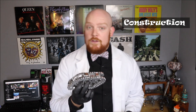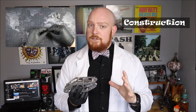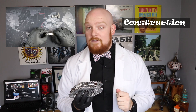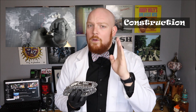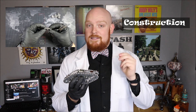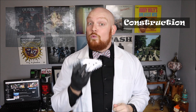My second point is about the transmission in the back. This build allows you to have both neutral and drive, but when building this particular part you have to be very careful to make sure all the gears are working correctly. Not only do you need one of the gears spinning freely, but you also want minimal wobble as possible, because when you're engaging the drive and neutral it may slip. Make sure all of these are extremely tight and you'll have a really good end result.